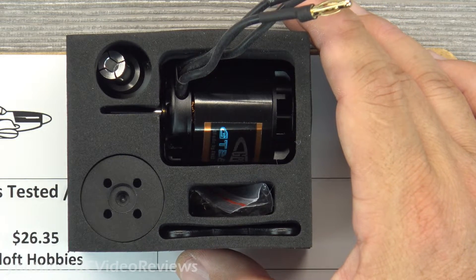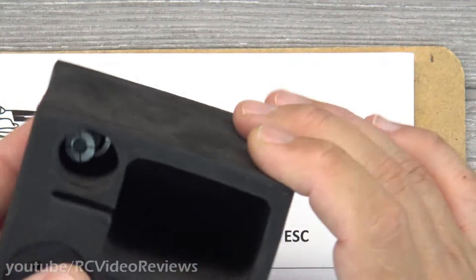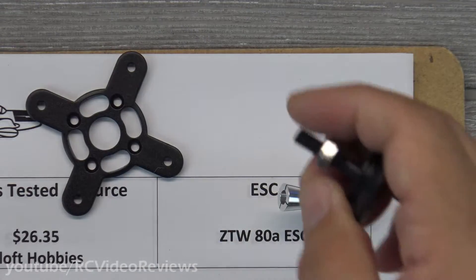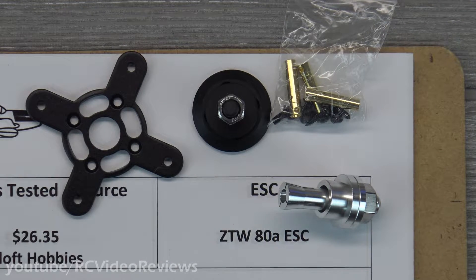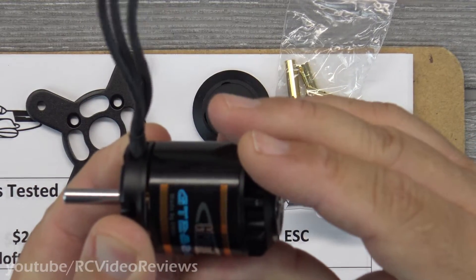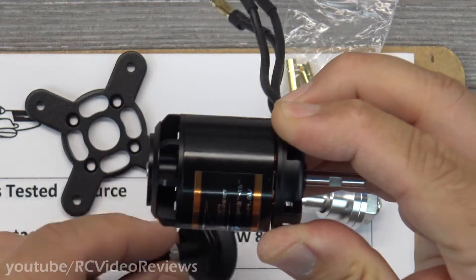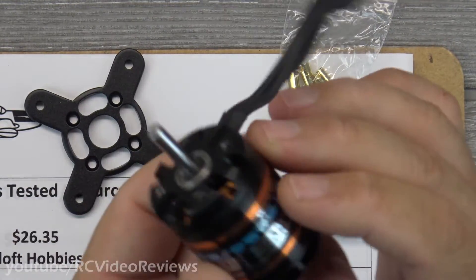You'd never guess that quality by looking at the motor. The bearings are very good, the packaging is very nice, and they have a very complete kit: the compression fitting, the screw-on prop adapter, a bag of screws with bullet connectors, and the radial mount. They send you everything you need to mount this motor — you can mount it as a forward mount motor, screwing in from the front and using the compression collet with the base as the mounting piece, or you can rear-mount it with the prop adapter up front, spinning like a rear-mounted motor with the shaft protruding out the back.